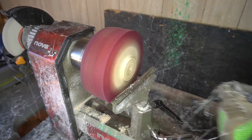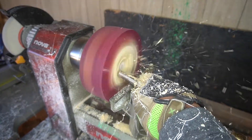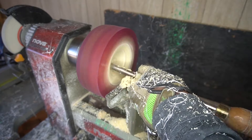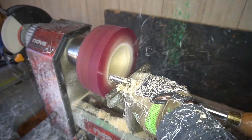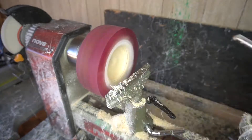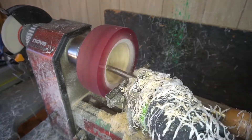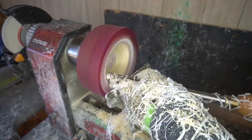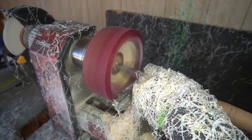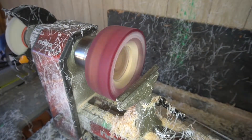Resting the tool on top to make sure everything is nice and cylindrical. Hit it with the square carbide tool yet again, and now using the regular bowl gouge to take off all this excess material. The middle portion went relatively well because of those pine board waste blocks, but the sides gave me a little bit of issue — had to go back and resharpen my bowl gouge. I wanted very thin walls on this particular project, so I had to use both the bowl gouge and the square and round carbide tool to get the finish I was really looking for.